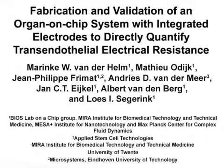The overall goal of this video is to show how to fabricate and use microfluidic chips with integrated electrodes for transendothelial or transepithelial electrical resistance measurements, or TEER measurements. This is demonstrated using a blood-brain barrier in a microfluidic chip.